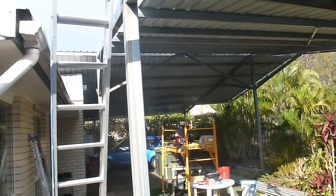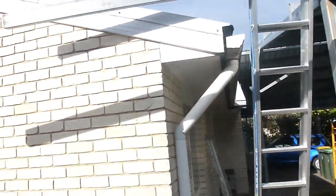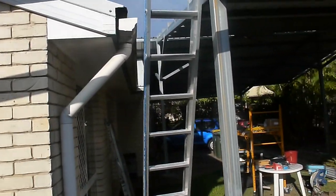Not sure how good that is. So the last part is to extend this roof across till it joins up to the old roof, and there'll be a valley gutter that runs down between the join between the two of them.